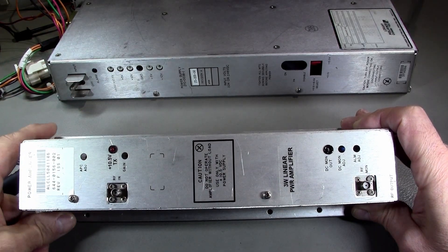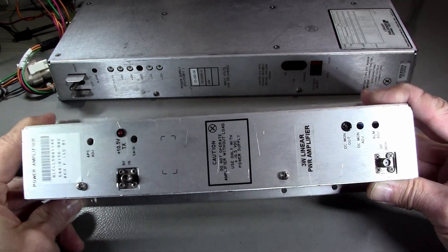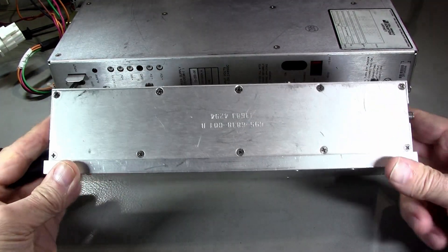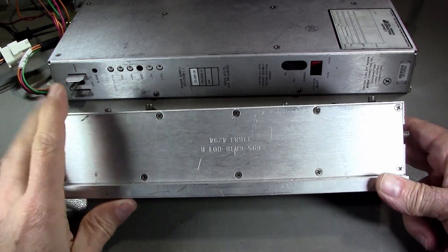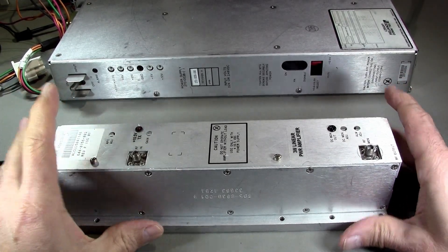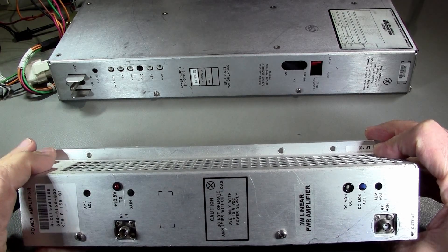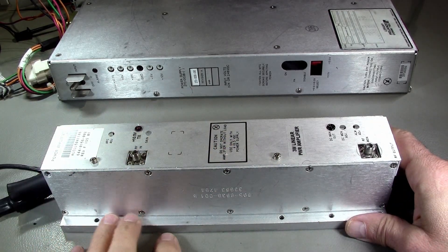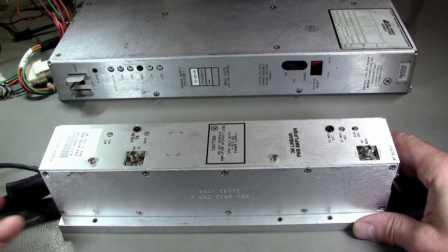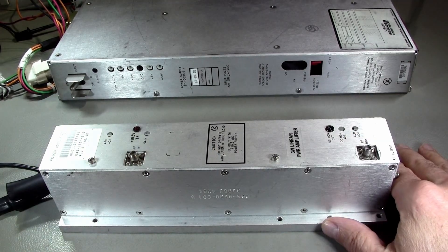So it's sufficient to drive a circuit if I want a power monitoring circuit — that's another good feature. This is heavy — it's almost four pounds, actually 1.7 kilograms. It's got a thick, heavy aluminum plate to dissipate the heat. I've run it for several minutes and I could barely feel any warmth on the plate. So for amateur radio duty cycle, this thing doesn't need a heat sink. In the original point-to-point microwave system that was always on, it needed extra cooling — I'm pretty sure there was a big blower and a big heat sink on the back. But for ham radio, not going to be a problem at all.